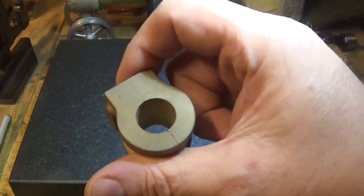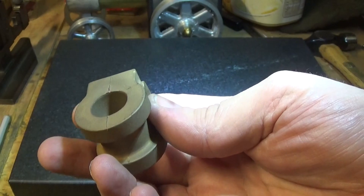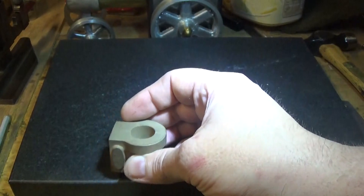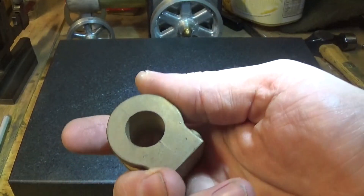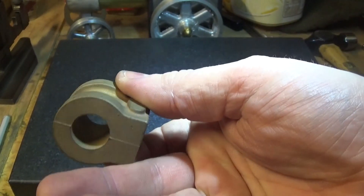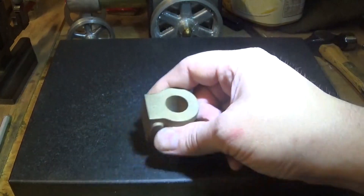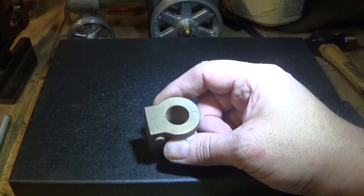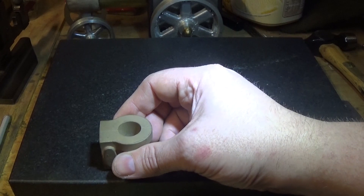I've been asked the question how to set up a cylinder. This is a really nice casting with a nice core — I think this is probably lost wax, something like that. A shell cast, it's a really nice job. But not all castings are equal, and some castings have an irregular hole. So how do we set that up on centre to bore it, with the least effort and the least messing around, and the quickest way to accomplish it and get reasonably accurate results?